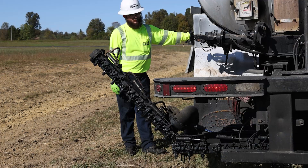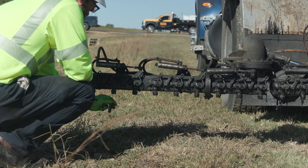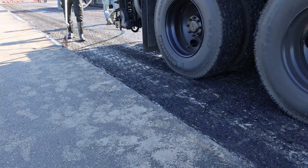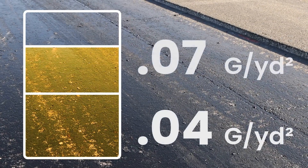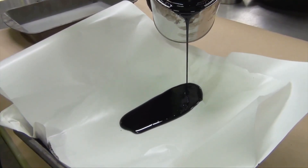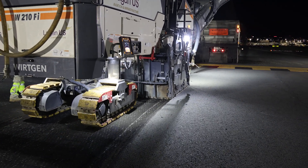In a streaking situation, clean the spray bar, adjust the angles and height, and apply the coat again to achieve complete coverage. The tack coat application rate depends on the target residual asphalt cement on the surface, typically between 0.04 and 0.07 gallons per square yard. Milled pavements may need more residual tack coat.